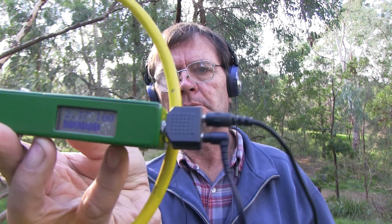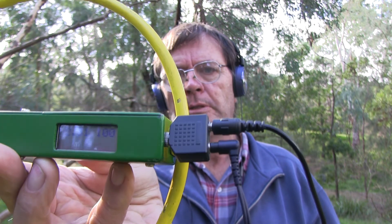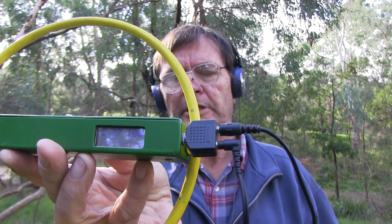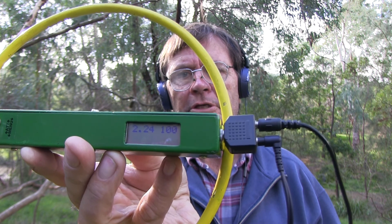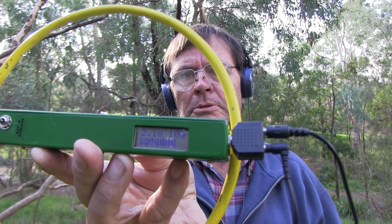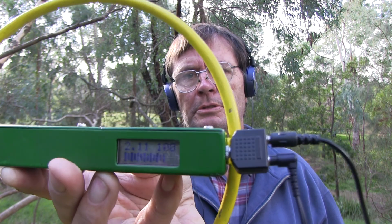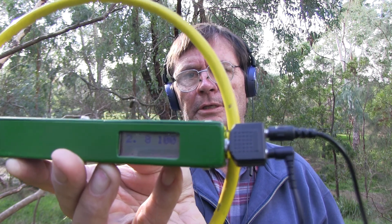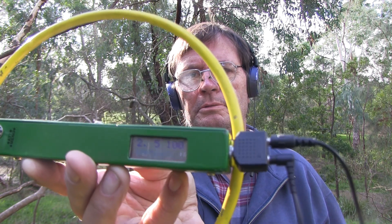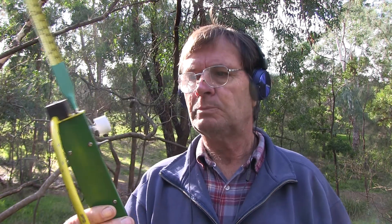I'll go through a couple of the features. It has a very nice little display — you can see the signal meter bouncing up and down. It's set up for classic mode at the moment: five transmitters, 60 seconds per transmitter. It's currently saying transmitter number two with 19 seconds to go. I've just got a homing beacon running at my home QTH, and on the right hand side there's a figure showing about 100 meters — roughly indicating how far the transmitter is from where I am.